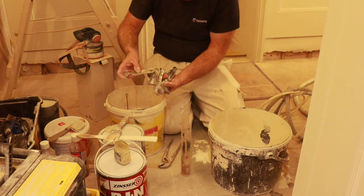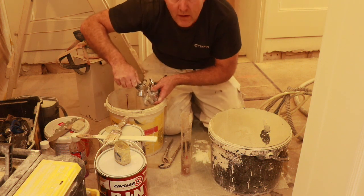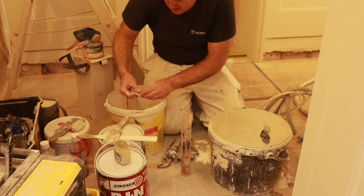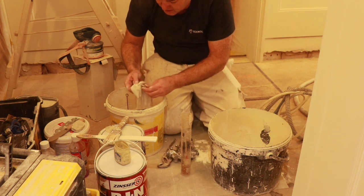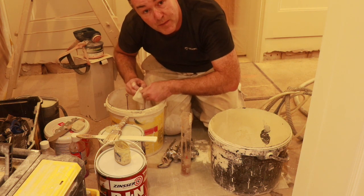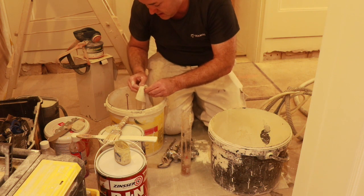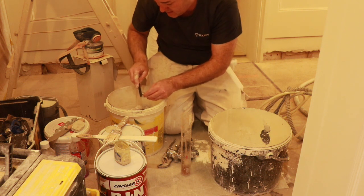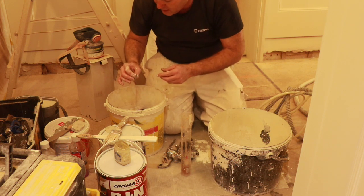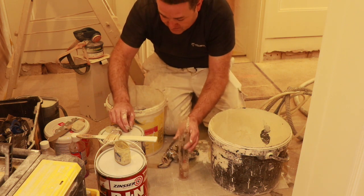Remove that orifice needle tip, whatever you want to call it, that's the 1.5, I'm getting that out. Run my cloth around it, make sure there's no paint stuck to it. If you do find you've got a bit of paint stuck to it, methylated spirits is also another one that softens up water-based paint. That's good, all the way around. Blow through it, check it. If it looks a bit clogged, this cleaner's in there to use, that's fine.